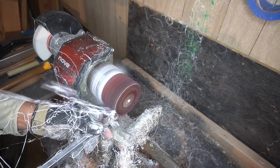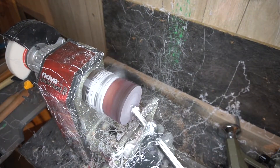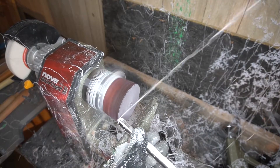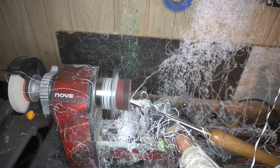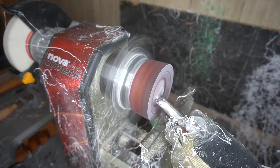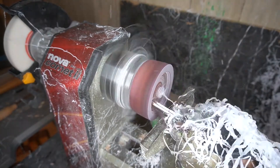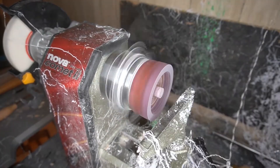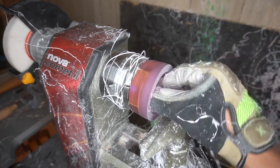You can see these cool ribbons that are coming off of the actual epoxy blank itself. I didn't know exactly how to approach shaving it down a little bit. I was going to initially take my square carbide tool and just mold down the actual blank itself, but I found that if I just took my regular gouge and hit it from the side angle, it went a lot smoother and I didn't have as much chipping. You can see all those cool shavings on the wall there. Once I had it basically to the size that I wanted, we started the gouging process with the square carbide tool. I did notice a little bit of chipping on the deeper cuts when we started to gouge out the middle, so I ended up taking the gouge and getting a lot of the material taken down that way versus just using the square carbide tool by itself.